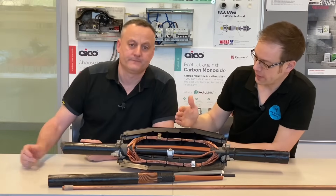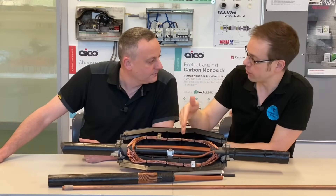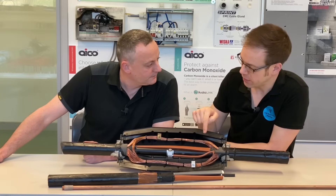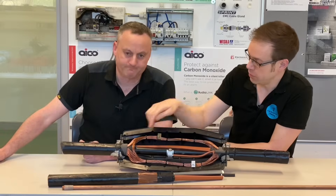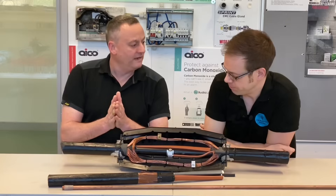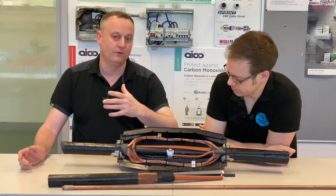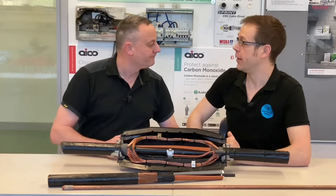What we've got here is a system that doesn't actually break the protective earth neutral. Under the old system of splicing cables and putting new connections to properties, the cable would have been cut through, which obviously creates a weak point — a joint that could fail. However, under this modern method, the conductors have not been broken, which means the chances of losing this protective earth neutral connection are pretty much zero. He was putting in 2000 or 1000 metre runs with no earth rod going in the ground — therefore no staking of the combined neutral earth.